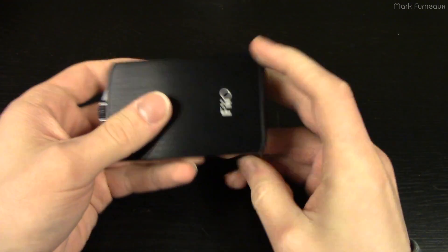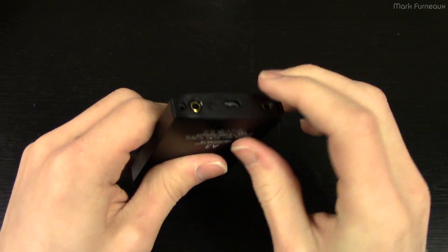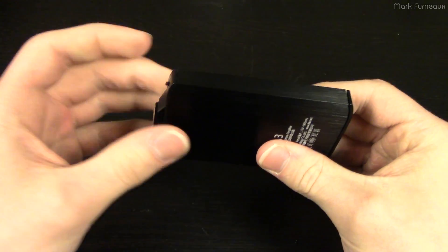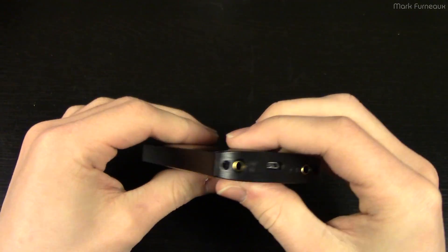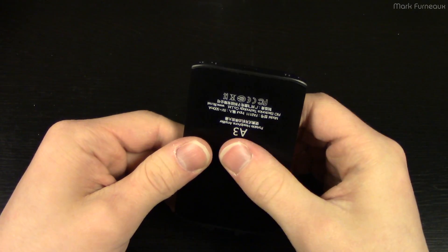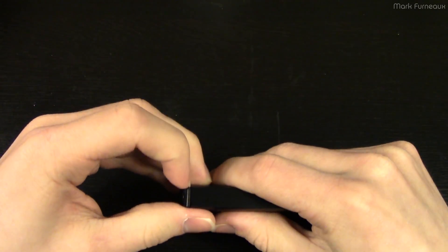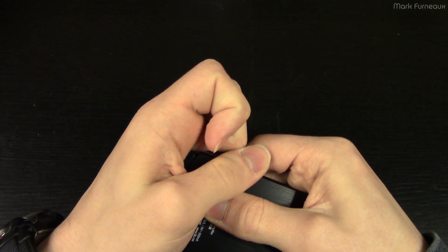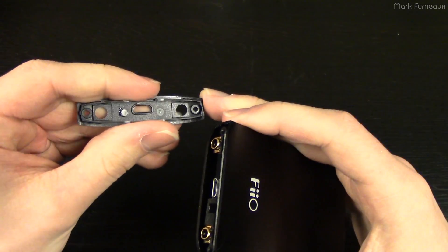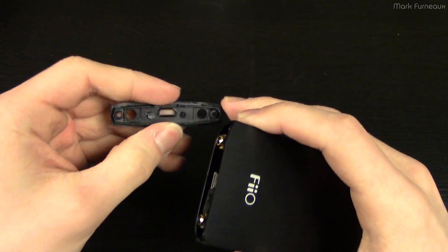It's just got an in and an out, micro USB for charging, and a little LED for on-off and charging status. It pulses when charging, so there's obviously a little micro doing PWM on that. It's a nice little aluminum case — obviously an extrusion. There are two screws here, and I thought I'd do this all on camera. I think it's just going to slide out one end, though I may have to take the volume knob off to get it open.